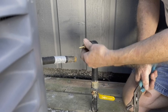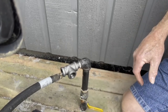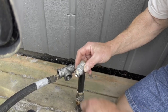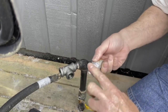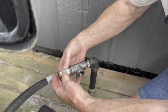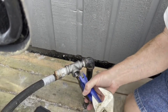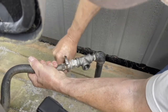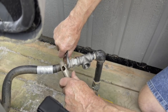I'm going to install a half-inch T and put the adapter back in for the manometer on the branch. Be careful when putting pipe dope on the flexible hose adapter — you don't want to get any sealant on the inside of the fitting. You can see the hose to the generator is slightly bowed, but this is only a temporary connection for testing. Finally, install the adapter on the branch and connect the manometer.